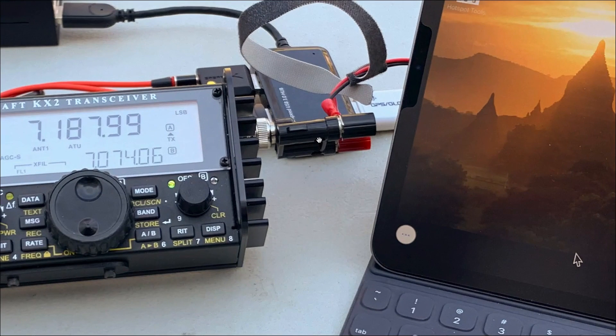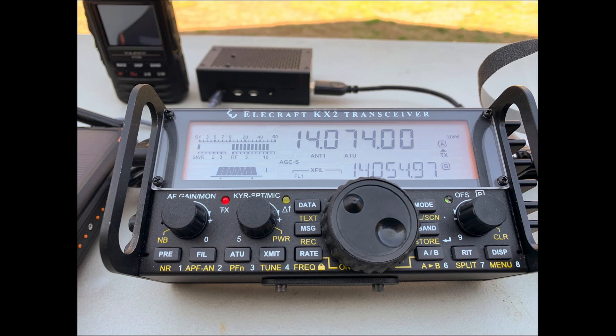Let's take a look at this connector — it's got a BNC connector on one end plugged into the radio, and the other end has two terminals, a positive and a negative. With this style of connector, you can use banana plugs, or you can unscrew them, loosen them up, slip some other terminals in, and tighten back up. This is what he's using with that 20-meter homebrew dipole. Taking a close-up look at the Elecraft KX2 — fans of these radios love them because it's super portable and can work all bands and all modes if you get the added modules, including 2-meter.